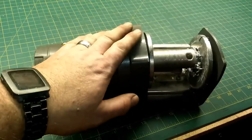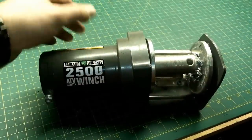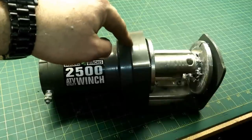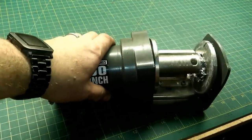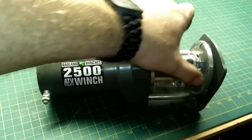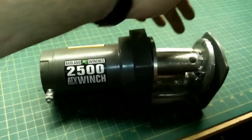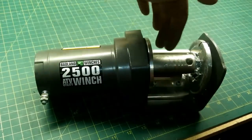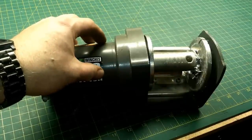We're going to use this to power the trailer mill. If you go back and look at some of my videos, you'll see a review on Harbor Freight winches. This particular winch destroyed itself, so it's a perfect candidate to reuse the motor. I'm going to use the spool — we're going to remove one end of the spool, take that piece off, and basically bolt a sprocket to the bottom half of the spool. We'll get a chain, and the chain is what's going to drive this unit.